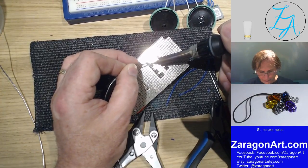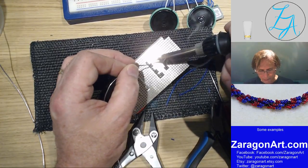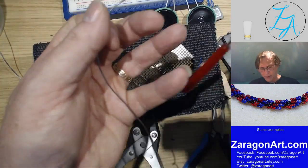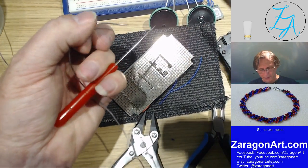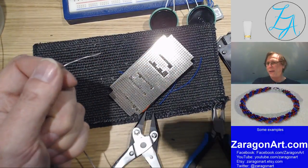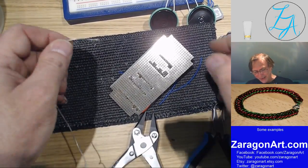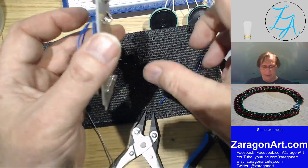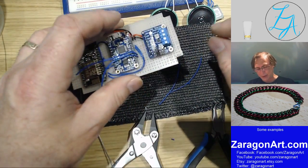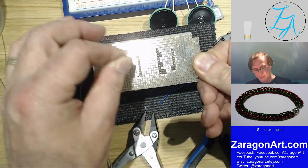And you tend to develop techniques like being able to hold two things with one hand, like you'll hold wires, and you'd be doing something like holding a wire like this and holding a soldering iron and solder like this and doing things like that. But you can get things called helping hands. They effectively look like a metal stand with crocodile clips on it, and they're useful because you can clip one to the board, which would hold it nice and steady, and clip one to the wire so the wire doesn't move.